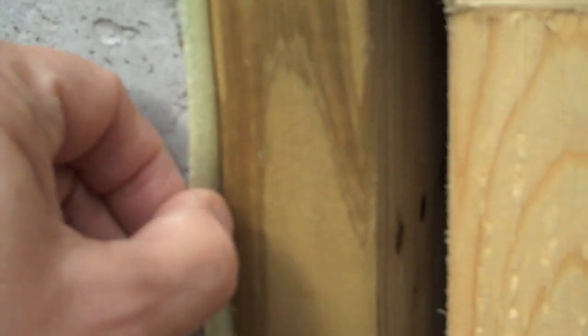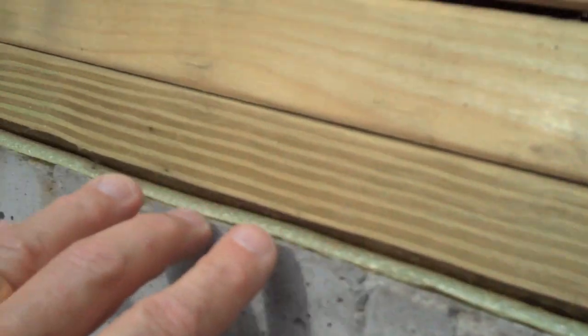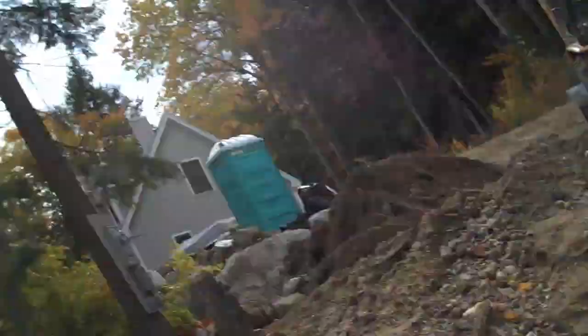Check this out — see this piece of foam here? Can you see this foam moving? That is very important. You want to put this foam in between the wood sill plate and the masonry foundation, both vertically and horizontally along the entire foundation, because this helps seal any air that might get between the wood and the concrete. Foundation contractors can't always get that concrete perfectly smooth, or the wood might have a little warp in it, but you need to seal that air to reduce the energy usage in your home.